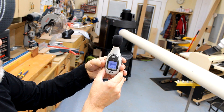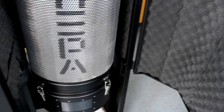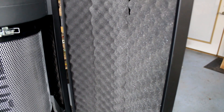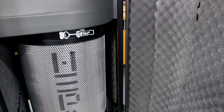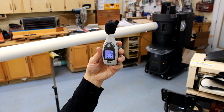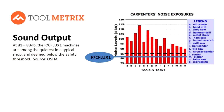For the volume of air produced by these machines, they're impressively quiet. Laguna has put a lot of thought into minimizing noise emission, particularly on the P-Series where they've added acoustic foam around the filtration system, bringing down the noise level by a couple of decibels. From 10 feet away at ear level, I measured an average of 83 decibels on the C-Flux 1 and only 81 on the P-Flux 1. As a point of comparison, a typical benchtop planer runs around 100 decibels and a miter saw in the low 90 decibel range — so this is going to be quieter than most of the tools it's collecting dust from.